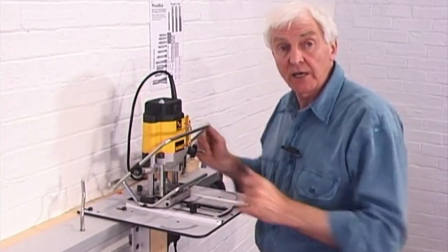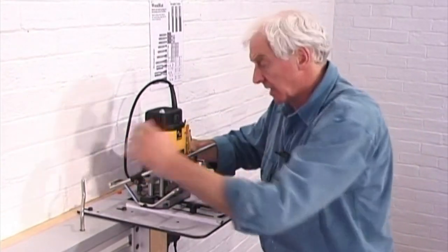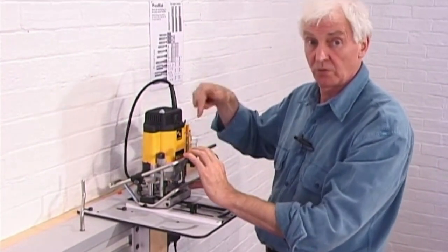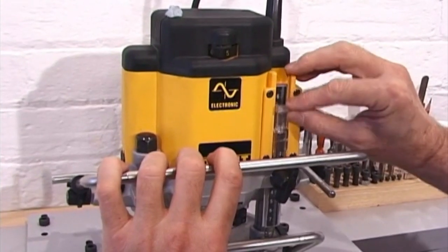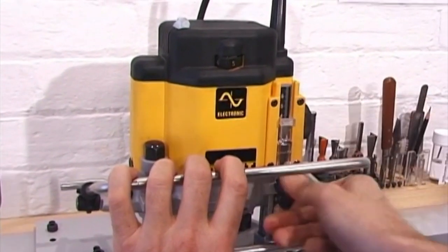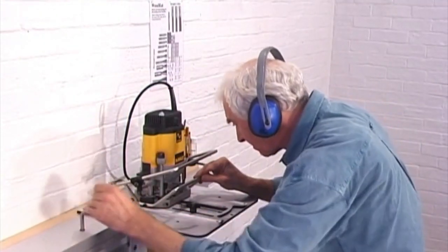In the WoodRat, it turns the push downwards on the work with two hands action into a simple single-handed squeeze that doesn't put any pressure on the work and leaves the other hand free to check the depth of cut. Or to track the workpiece.